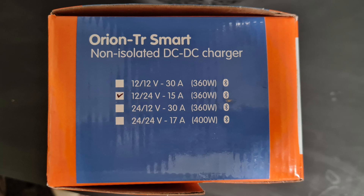You want the 12/24 model — the first 12 means that's the input voltage, the 24 means that's the output voltage — and then they come in different amperage ranges. I got the 12/24-15, which is a 24 volt 15 amp output. That takes a 12 volt 30 amp input. It works just by multiplication and division: you double the voltage and halve the amperage. So 12 volts to 24 volts, 30 amps to 15 amps.